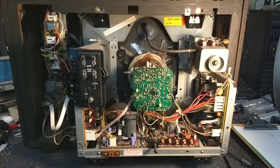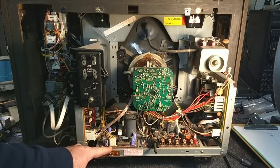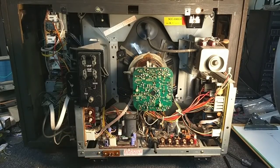And then I also use that map to note the capacitors and their polarity and their positions. Because, again, I don't trust my own memory, and I've had problems putting things back together when my memory fails. So I also take the time, because the boards are marked F4 for this connector, F5 for this connector, etc., and I will write on them.